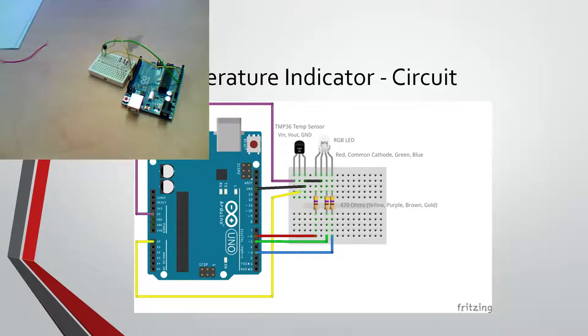And then, for analog out on your Arduino, if you look at these little squigglies, those are pins that can have analog output. What the little squiggly means is it's not exactly analog output, it's something called a PWM signal. It mimics an analog output, but it's not actually analog. An actual analog output would output, say, 3 volts steady. But what PWM does is it sends a series of pulses in certain widths. Let's say you want an analog out of 50%, in this case 2.5 volts.